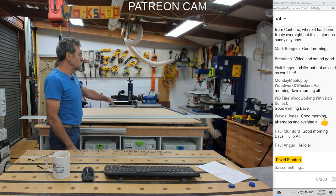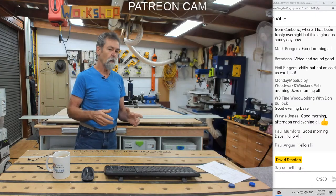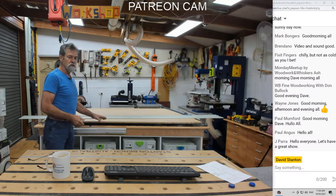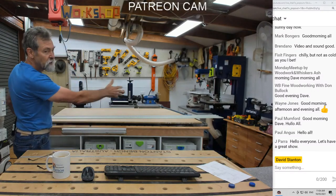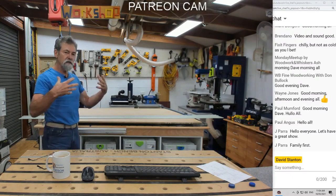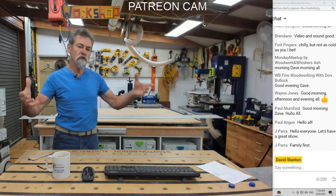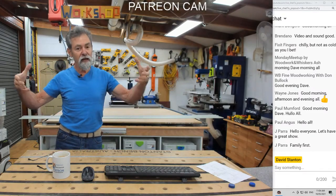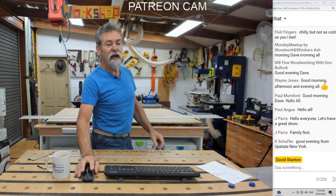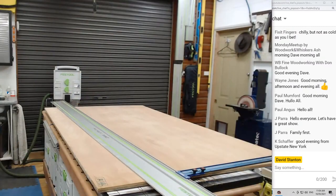Okay, so the first thing I'm going to do is rip this, and I'll show you a couple of things about what I'm going to do with this. This board is not as long as the bench that I've got it sat on or the sacrificial door that I use underneath the track saw. So what I'm going to do is use the parallel guides as a holder, as a clamp. And it'll be tricky. Family first. Thanks. I'll switch cameras to this one and show you what I mean.